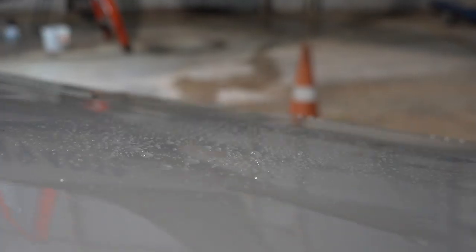Today, with all that rain, it's pretty humid. And because the airframe is still cold, there's actually moisture condensing on the body. So we're going to wait for that body to heat up a little bit, so we don't have water while we're trying to coat. That's a big problem, actually. While I'm waiting for that, I'm going to continue polishing the underside and the wings, and we'll touch base at some point during coating.